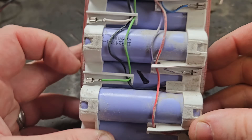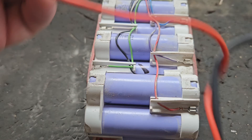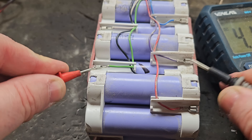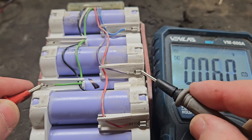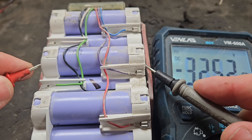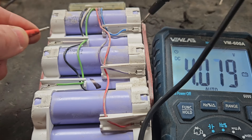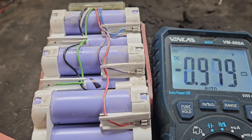Remember it's marked with a little black dot. We'll just check it — you can check it from one side to the other with these wires, or you can check it down here, it doesn't matter. 4.18 volts. So it's a little bit higher than the rest — we overcooked it slightly — but it's not significantly so, it's all right.